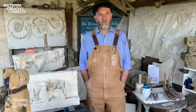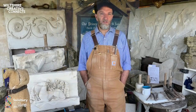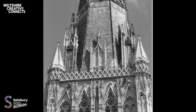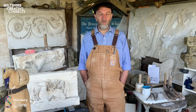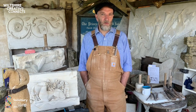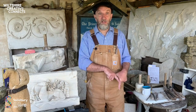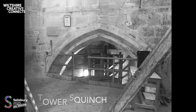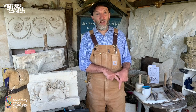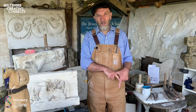My very first project after leaving Weymouth College was as a trainee at the Cathedral. Here I was working at the point of transition from the square plan of the top of the tower to the octagonal base of the spire. So how is it possible to transfer a square to an octagon? Quite simply, by introducing an arch into each of the four corners. This is a device known as a squinch. So that's the square of the corner of the tower, and the squinch spans or bridges across. What I love about this is that this is an engineering solution devised and utilised by Islamic engineers to support dome structures. So no architecture of Islam, no great spire at Salisbury.